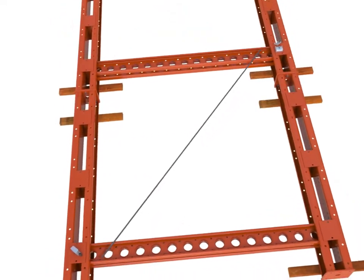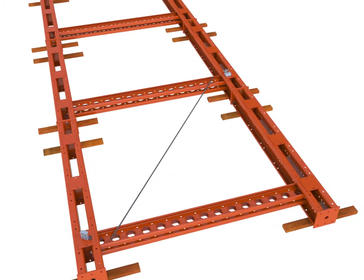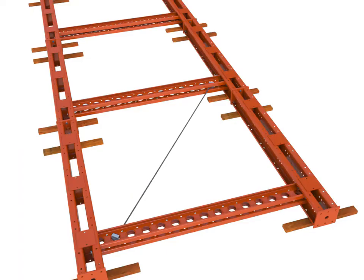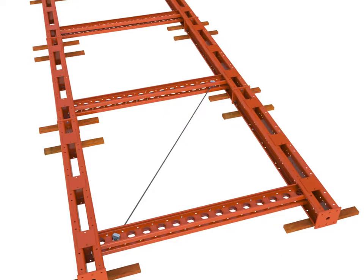Attach bracing to form a braced frame. In this case, rapid bar tie bracing is being used. The porthole bearings are installed into the appropriate portholes of the super slim members. The first end of the rapid bar tie, cut to the required length, is inserted between the webs of the super slim member and through the porthole bearing, and the rapid bar tie wing nut is installed. The rapid bar tie is then pushed back and the opposite end is inserted between the webs of the super slim member through the porthole bearing and then fastened with the rapid bar nut.